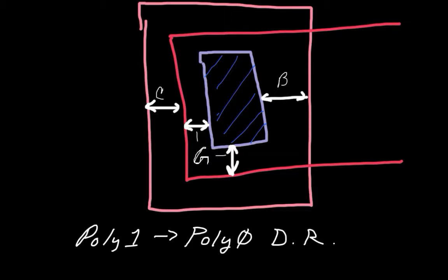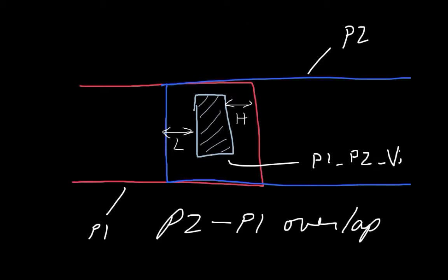That's usually in the tables in your book. It'll say nominal and it'll say minimum. Try to stick with nominal — nominal might be four microns, minimum might be two. Only use the minimum design rules if you have to, because there's a probability they may not print to the same size as what you're thinking they should print. So these are the overlap rules, or the enclosure rules that I'm pointing out here.